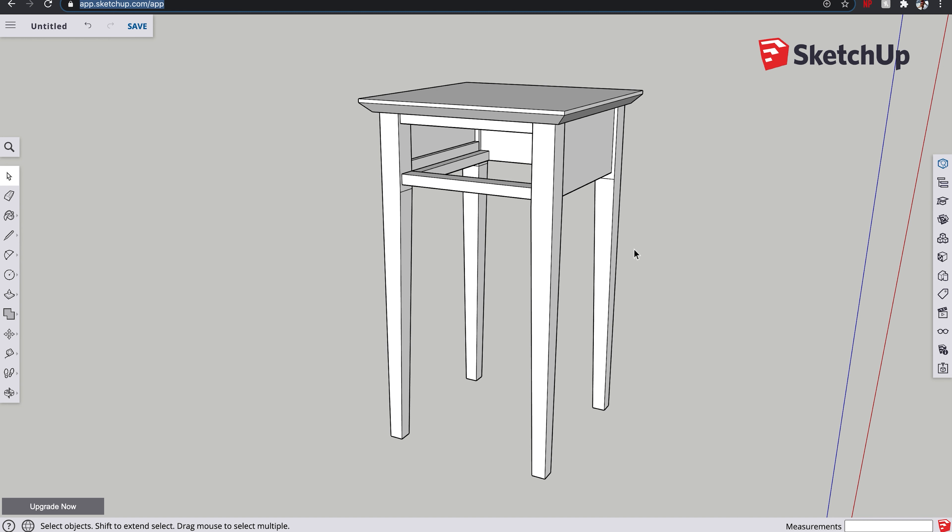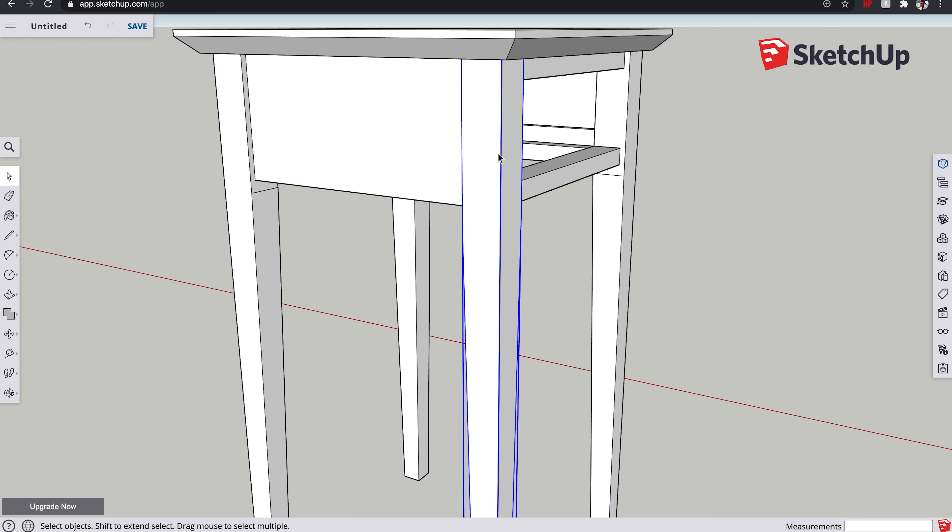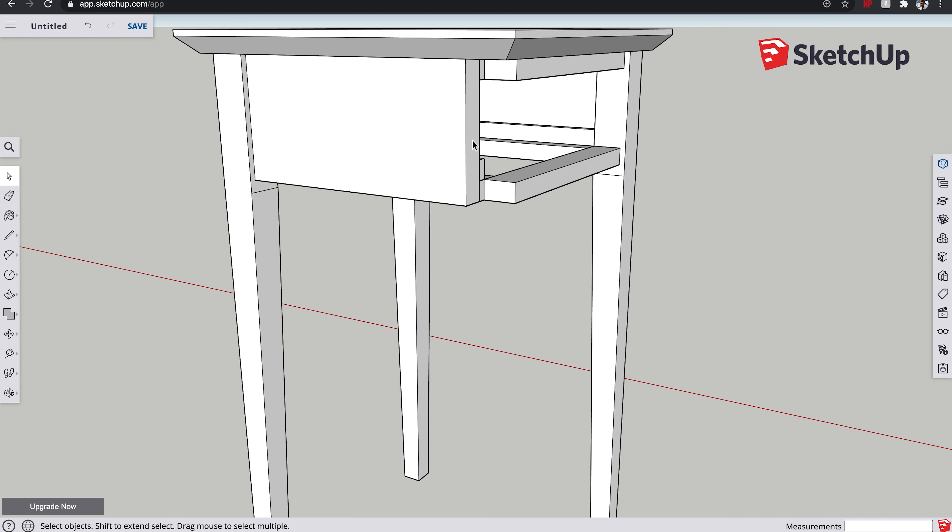This is just a basic shaker table with four legs. These will be mortise and tenon into the legs and we've got a cavity here that will fit a drawer. This drawer is going to have lapped dovetails on the front and through dovetails on the back, with a base slid into it — a properly traditionally constructed drawer with a lot of detail. This model at the moment doesn't have any joinery. We will be adding a tenon to the stretchers and a little dovetail to the top rail and a tenon to the bottom rail.